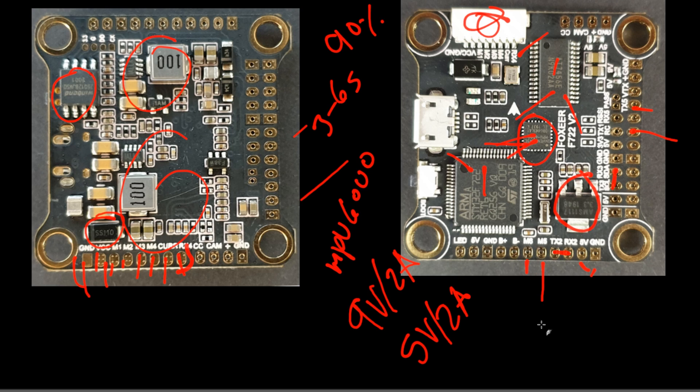You also have motor 5 and motor 6 outputs, which we don't see that often nowadays. For the voltage output to your camera and VTX, there are solder bridge pads. By default it's bridged to 5-volt configuration — always double-check this, because if there's no solder bridge, your VTX and camera won't get power. There are three pads: bridge the middle with the top for 9 volts, or the middle with the bottom for 5 volts. The VTX section has ground, 9-volt, your video (yellow) wire, and smart audio — and if you have a 5-volt VTX, you simply bridge those two pads. Same exact connection either way.